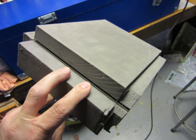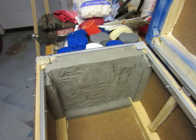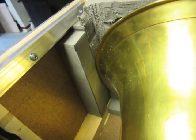Its main downside is that because of its closed cell nature and its being chemically inert, it's hard to find adhesives that'll work on it. So when shaping it for the case, it's always important to get it to fit precisely and tightly and have as many contact points with the case on different sides of the foam, so that even a small amount of adhesion from the adhesive that we'll use is enough to hold it in firmly.